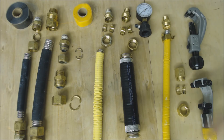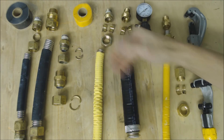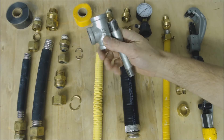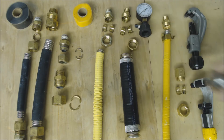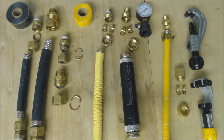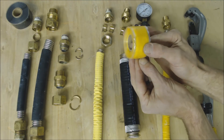Also, in an earthquake zone — a location with a lot of seismic activity — CSST may be much more preferable than something rigid like schedule 40 galvanized gas piping. I believe everything has its application; in some areas schedule 40 is more preferable, in others corrugated stainless steel tubing is.